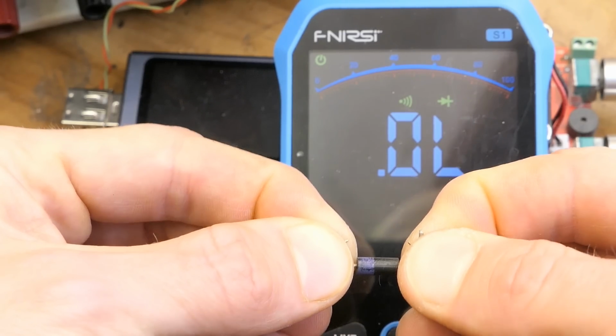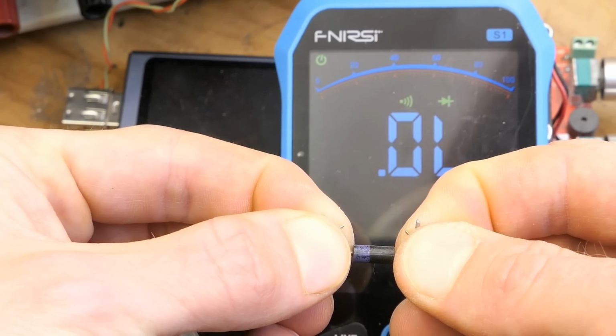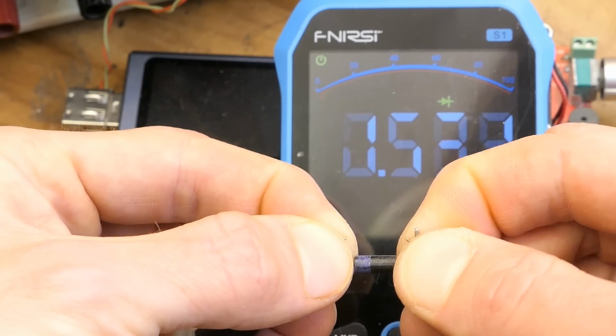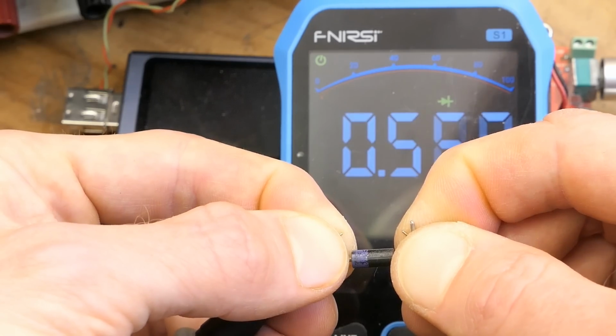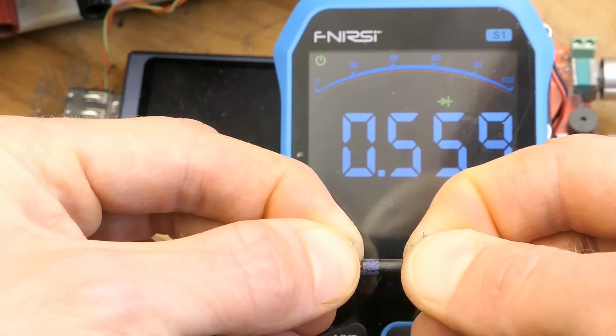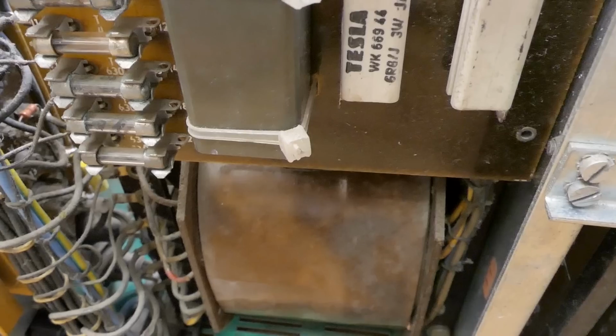When I try to bend the pins, it seems to occasionally make a connection. It seems like the bond wires fail in the diode, or it mechanically loses the connection to the silicon die, or the pins get loose in the plastic housing. Now the violet diode is in the board, and let's test it. Now it's the right type of buzzing.